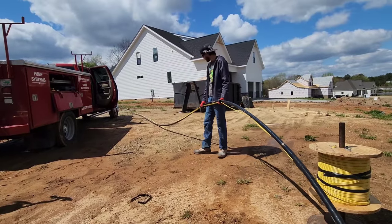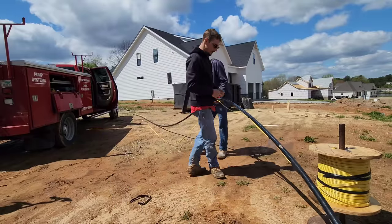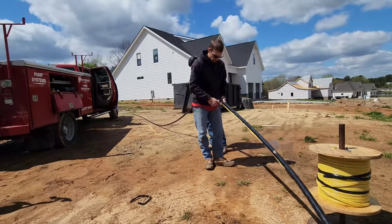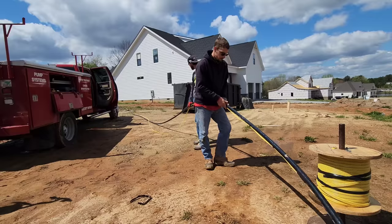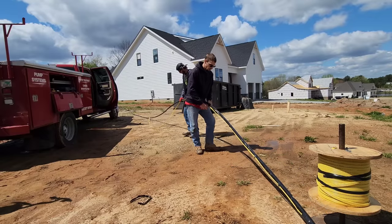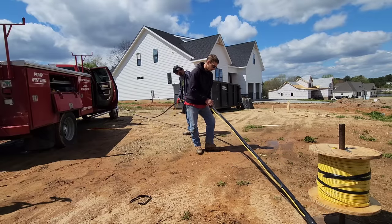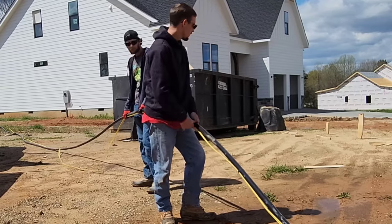Now we're just going to tape it every two to three feet all the way up. This really doesn't matter as much because the system is all going to be encased in the casing. But typically when it goes in the borehole you've got to worry about the wire chafing, so a lot of people put hole-centering devices — little round plastic rings — or they use torque arresters. I've just seen too many nightmare situations with torque arresters that cause bigger problems than they prevented.